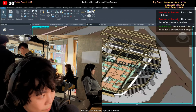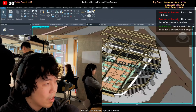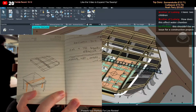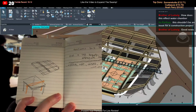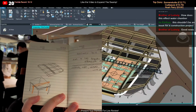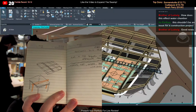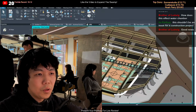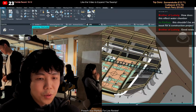Oh, so are you essentially saying I could take out that whole spine? Yeah, like the metal one. Right now it seems like your metal is running through one part of the thing, where it is still only taking the same amount of weight as all of the other wooden ones. The metal one is not actually taking more weight than the wooden ones. It's taking the exact same amount because they're all supporting the structure at the same height and same base. If you imagine a table and you add another row of supports, it doesn't mean that support would take more weight. It's only when that support is extra long that it begins to take more weight. If you get what I mean?